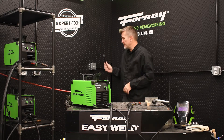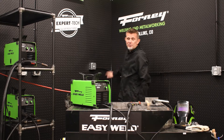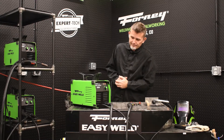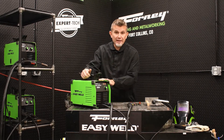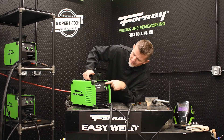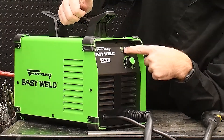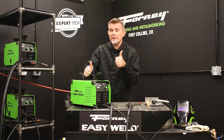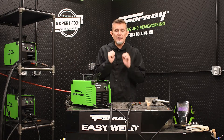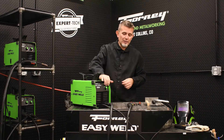All right, so I'll take this power cord and plug it into my 120-volt outlet. I'll go ahead and turn the machine on. I hear the fan kick on in the machine, so that's a good sign. I have a green LED here. It says my input power is good. I don't have any error lights, so that means I'm ready to go. I have the proper air pressure coming into it. So that's how you start it up and you check for your error lights.